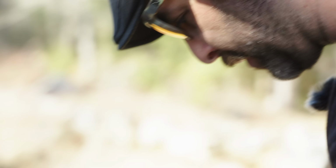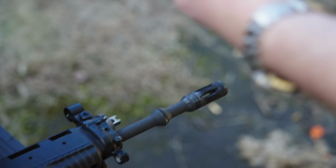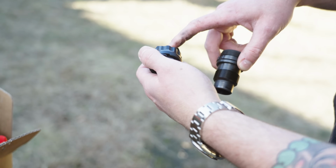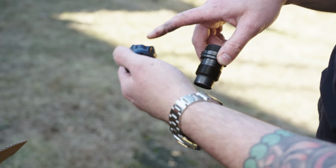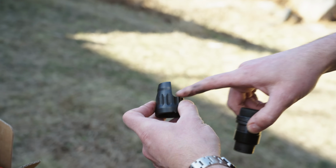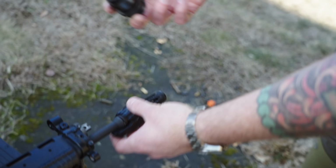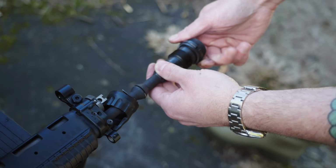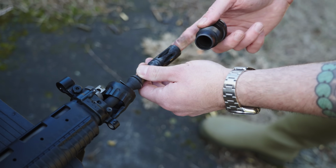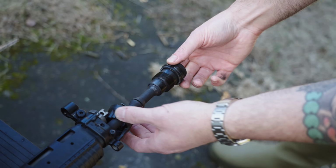So this is the factory muzzle device. It's machined into the barrel, but it has this nice tapered collar back here, which is synonymous with all of them. This is a B&T hub adapter for SIG 55X, X meaning whatever number SIG it is. The taper on the back of the muzzle device is kind of like a universal angle. So it's weird, it's like a 50% cutaway, but you put this over your muzzle. This right here, so you just let that hang. This right here kind of press fits over until it stops. So the muzzle device face is sitting flush to this flange here, goes on over. It's almost a press fit, it's really close.